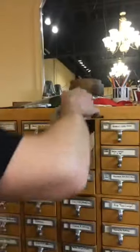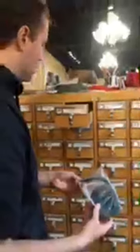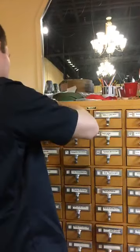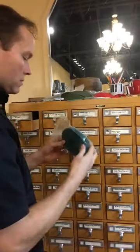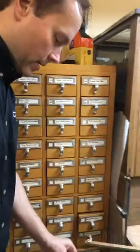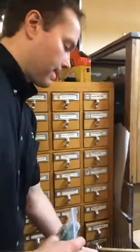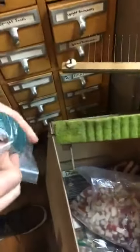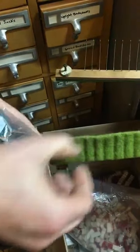I'd like you to clean this up right here. Replace that, probably with this. Inch and a quarter. This is larger than an inch and a quarter, but that'll be all right. Just make sure you don't use so much glue that it oozes out over the top and gets onto the top of this. I would like this to be flush with the top. So this will be slightly narrower. I'd like it to be flush with the top, not flush with the bottom.